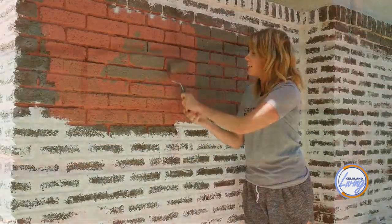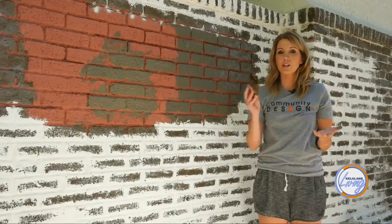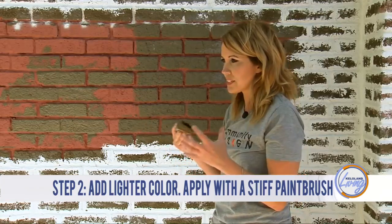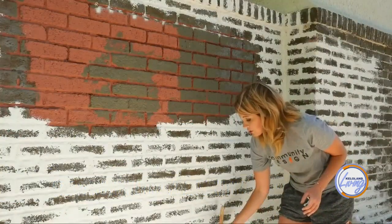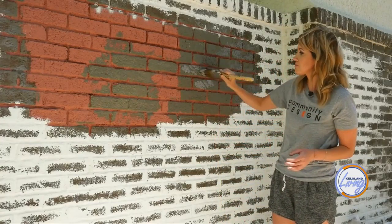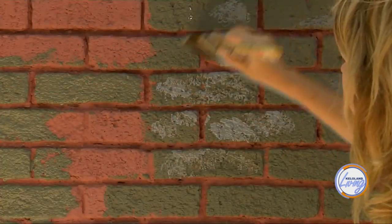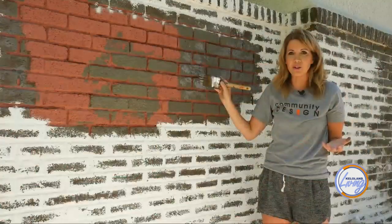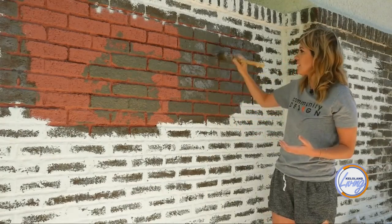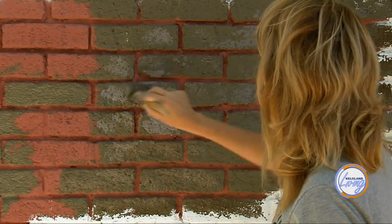I'm trying to get a pretty thick cover. For the second color, I'm just going over with a large brush. Don't use a very nice one because it's going to get kind of wrecked, but a nice large brush with a stiff bristle is going to work really well. Make sure you don't have too much paint on there and start to just kind of stipple it on. Don't cover up too much of the gray — you want that to show through. The key here is just to make sure it's really varied; you don't want it to look perfect or the same as you go across. More in one area and not that much in another, and that's all you're going to do — go across all the brick you painted dark gray.